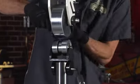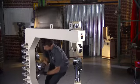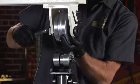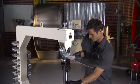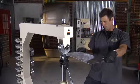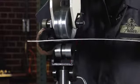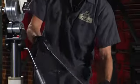Now let me show you how this works. I'm going to pull the quick change, pull the upper out, and replace it with one of our other dies, which matches. Switch it out. Okay, now that's simple. Lock it off and it'll turn it into a bead roller this fast. Watch how cool this is. Now I'm going to start with a beginning pass, crank it up some. Turn it up. Now, wheel it through. Now we've got a beginning pass. All right, look how nice that bead is.